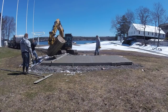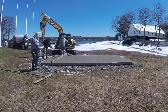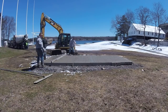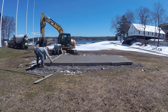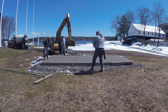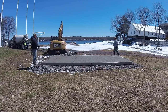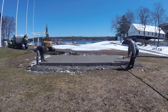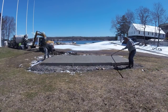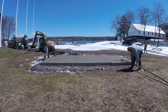We did two more pads just like this up on the hill — you can't see them in this shot. We did three of these today in all, totaling about 10 yards of concrete. Now that it's all poured and straight-edged, my guy's going to bull float it. The bull float pushes down the rocks and brings up the cream, which makes it really easy to finish.